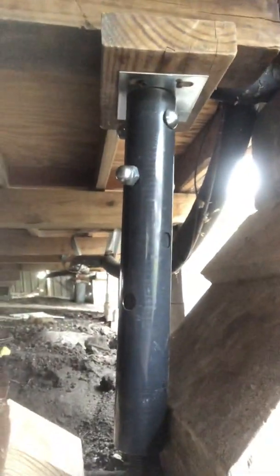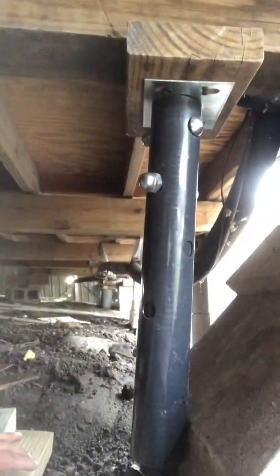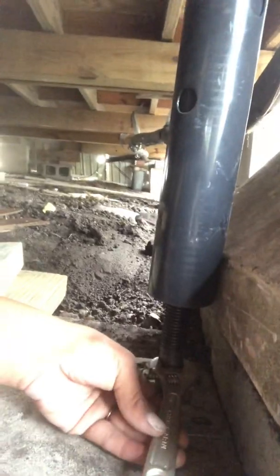These right here are really cool but they're expensive — they're called post jacks. They come in different sizes, you leave them there for support, and they act as both a jack and a support so you don't need bricks. You just have your bolts, and down here I have a wrench — you just lift up the house and tighten it at the same time, creating your support by twisting. It's pretty tight now so I'm basically done under here with this part.